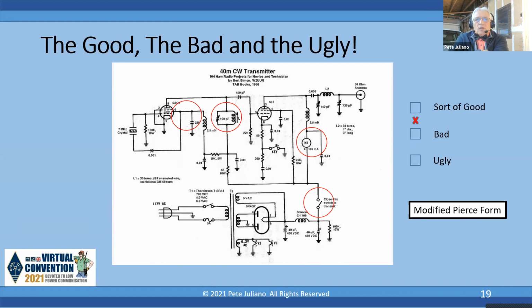When the switch is closed, what happens is the 6AG7 part of the circuit is powered on. So you're not keying the oscillator. The oscillator is turned on, and essentially what you're keying is the amplifier, the 6L6. And look, he's got a key click filter near the 200 ohm with a 0.01. So he's doing a little keying shaping there. But one problem with having the oscillator on all the time and then keying the final amplifier is a phenomenon called backwave. Some of that oscillator energy can sneak through, even though the key is up.